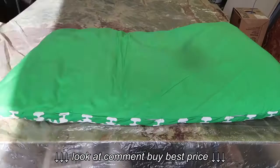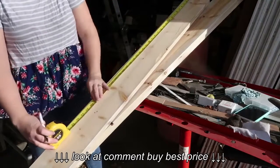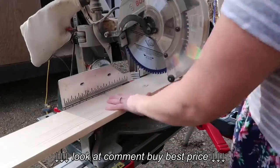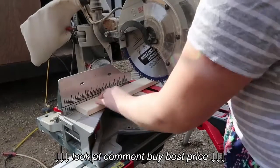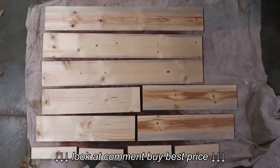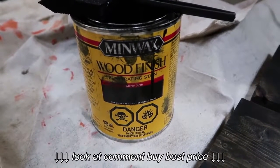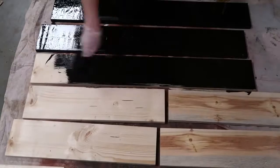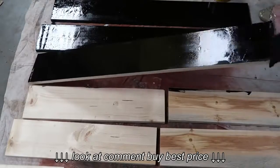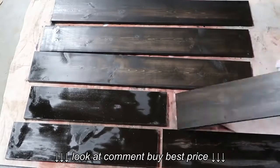To begin, I made a DIY dog bed. I found a cushion that measures 24 by 36 inches, then bought some pine — one-by-six and one-by-three — and cut it to the sizes I needed. For the bed I cut three 37.5-inch pieces, two 22.5-inch pieces, and four 11-inch pieces of the one-by-threes. Then I used one of my favorite stains, Minwax Ebony, and stained all of the pieces, wiping the stain off after a few minutes to get this beautiful dark brown color.